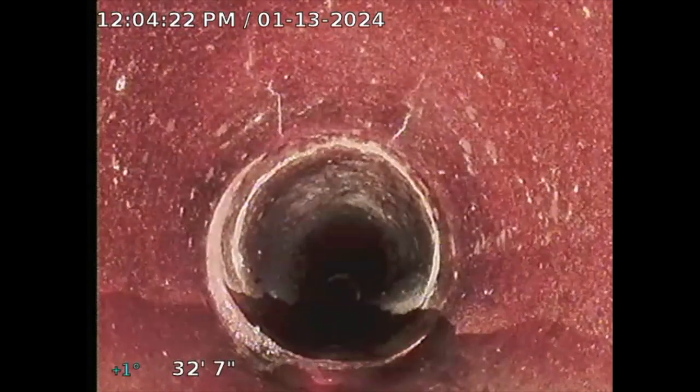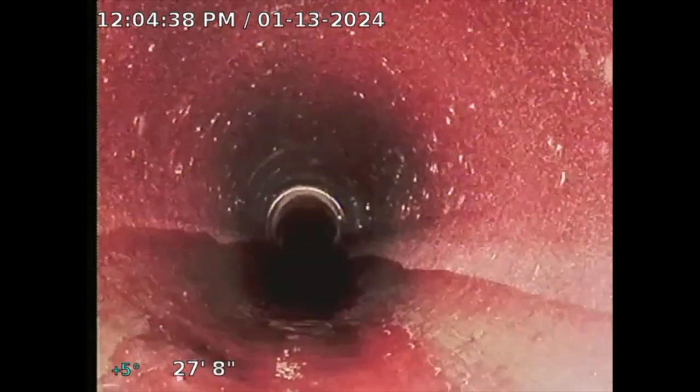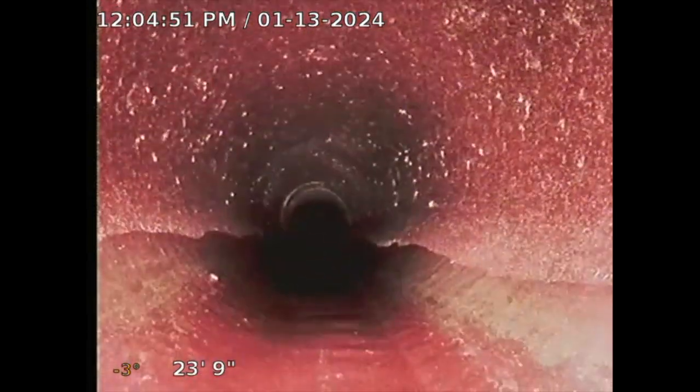It's up to you whether you want to pursue repair for that small crack. We saw more cracking in different areas, and that's typical for sewer line. I don't see any obstructions or tree root intrusions. Now I'm just retracting my camera. There are some small cracks — these could have been formed when the main sewer line was originally installed, back around 1948 or whatever year it was.